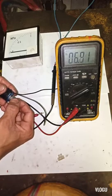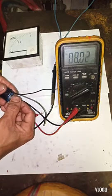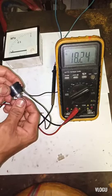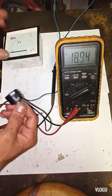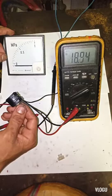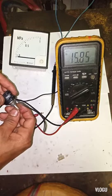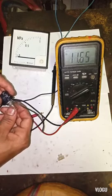I put it to the maximum turn to see how much the milliampere output is — we have 18.9 milliamperes maximum. If you connect the analog meter here I think the equivalent value is about 1. So I put it back to the 4.8K ohms resistance value of the potentiometer.